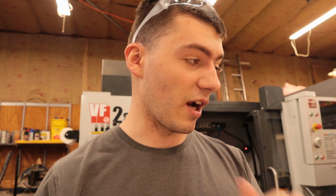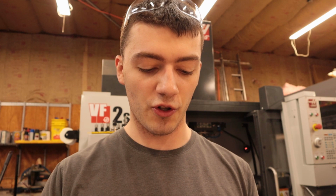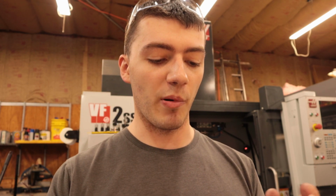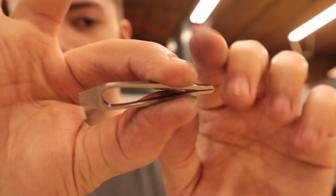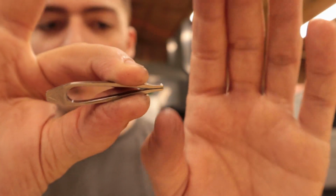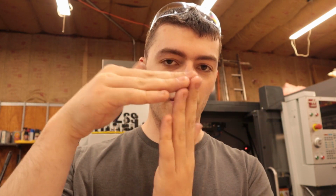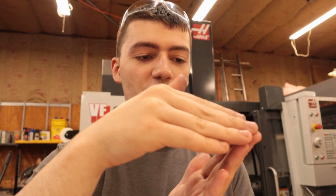Obviously, if the jaws aren't contacting each other on the tweezers, they're kind of useless. Something really important about tweezer design that I've discovered is the tweezers shouldn't contact over a lot of surface area, but just at the tips. You only want to bite up near the front, because if you bite towards the back, it's not going to work. There's actually an angle in there that keeps them from touching, so when you squeeze down, the jaws don't deflect when they hit each other. They're always trying to grab whatever's at the tip, because that's all you care about.